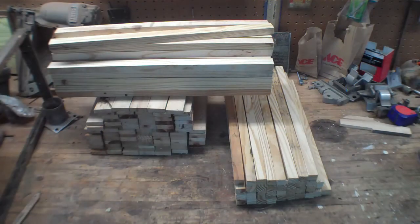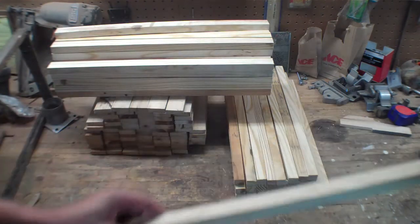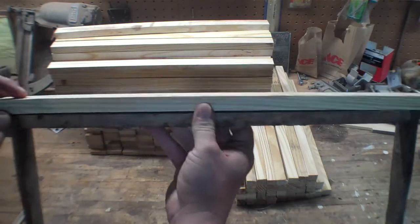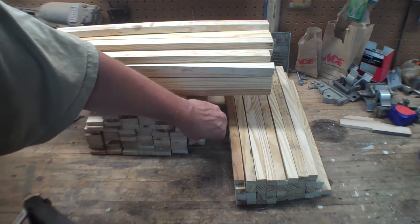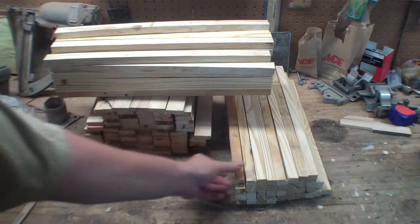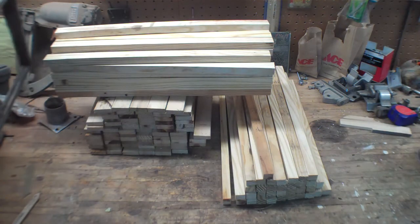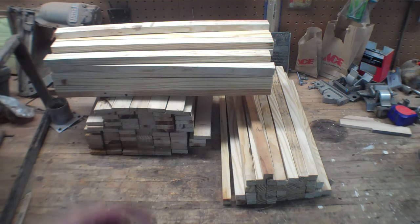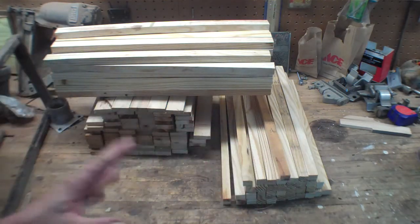Over the course of the next 2 or 3 videos, I'll show this stuff off and let you know what's going on. What I've got done so far — game five, so you can tell I've been dorking around with this for a while. These here are going to be the tops. Of course, there are still steps left to be done. These down here are going to be the sides, and these are going to be the bottom rails. All of these were cut out of pieces of wood — not only 2x4s but those other scraps I had hanging around. As long as you get the right dimension and length, and the longest pieces are like 19, 19 and a half inches, you can use some pretty small pieces of wood.